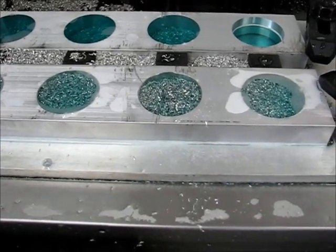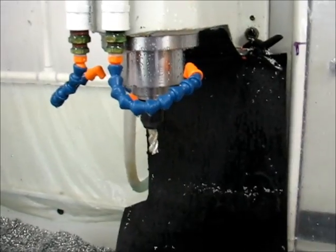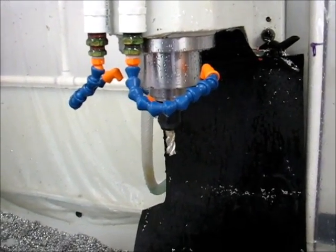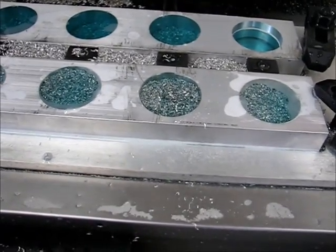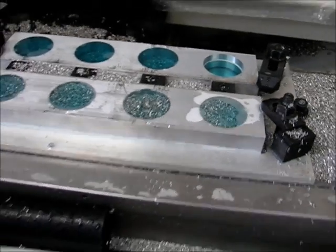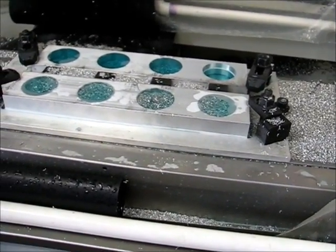Removing the chips manually is definitely more tedious. What I've done in the past is actually turn the coolant on — this is when I had the Tormach original equipment-style coolant system — and let the coolant flow until the pockets were emptied out, maybe help it along a little bit. But that was a few minutes on the tool change.